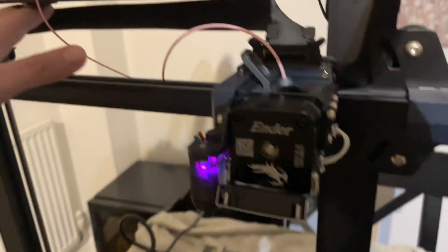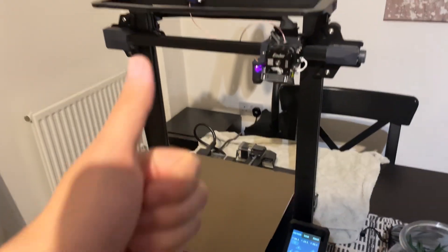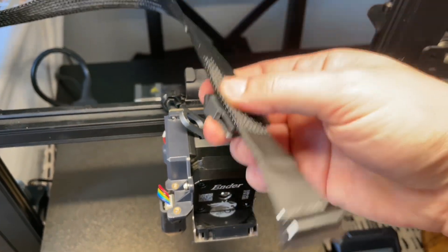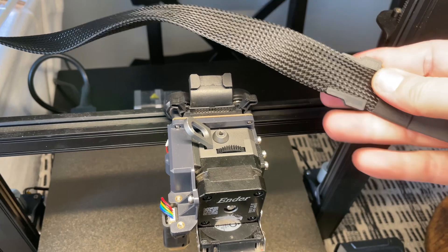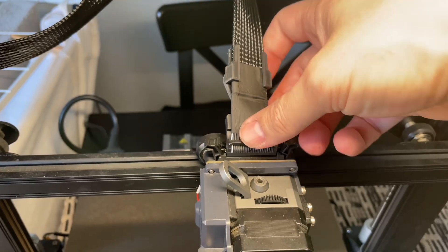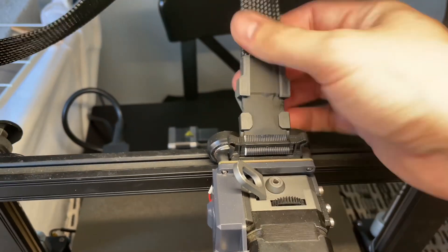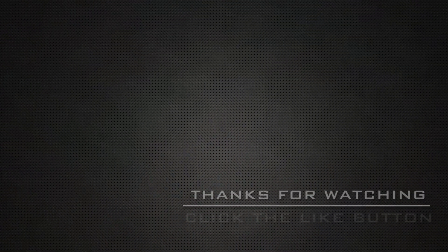With the printer extended, I still have a bit of slack on the X axis and a little on the Z axis, so everything looks okay. To prevent this from happening again, I found a model on Thingiverse — I'll leave the link in the description — it's a little bracket extender that should avoid a lot of the bending forces and stresses that the cable suffers right at the joint. You just push the bracket into the original bracket and slide it down to extend the cable's relief. Thanks for watching, see you next time.